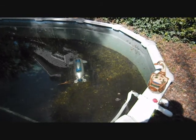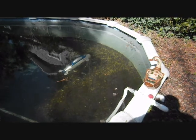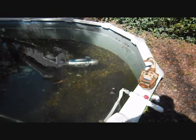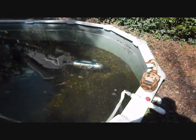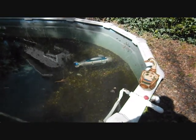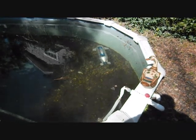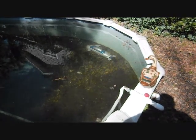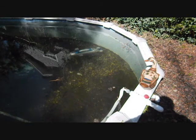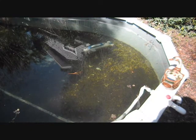Variable speed left and right thrusters allow for precision handling of the SB-2. It works in conjunction with the rudder, and the ESC that controls the thruster is engaged or disengaged at will — that way there's no wasted power when you're just underway going straight ahead or backwards.